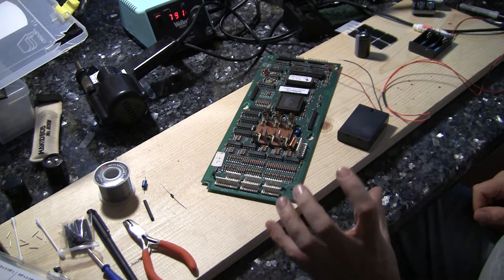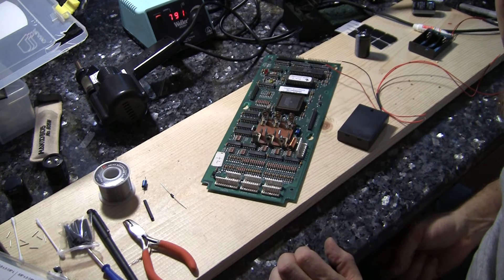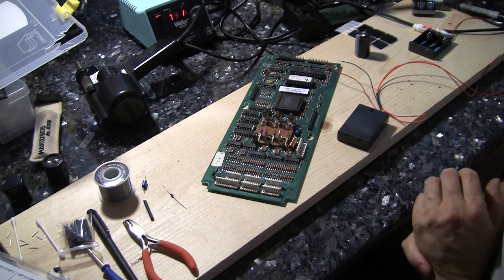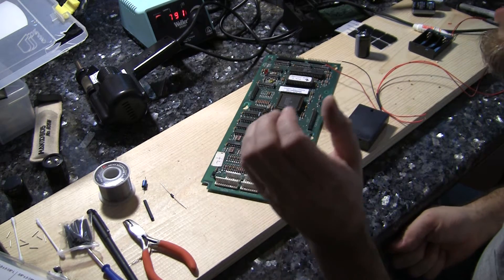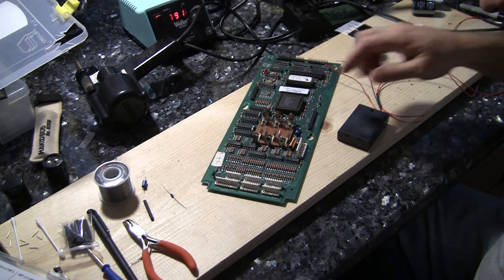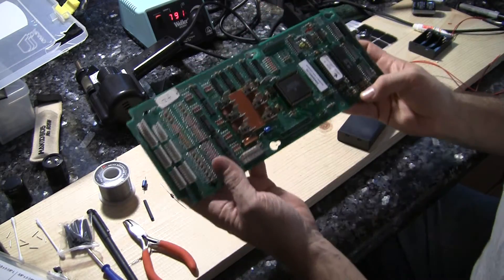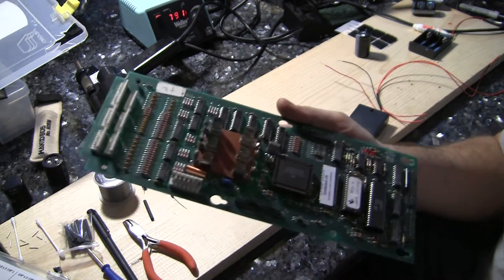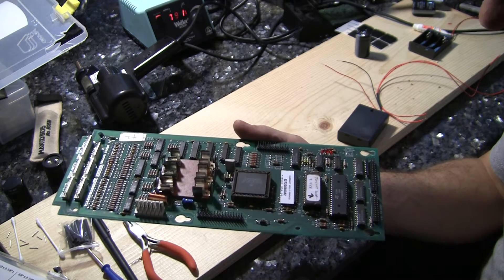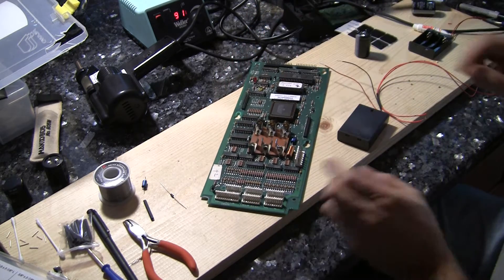So it's always a good idea to get those batteries off of the board. Some of the later models had little daughter boards with the batteries on them so that they didn't necessarily damage the board. But most pinball machines — almost all solid state machines — have batteries in them, and in some cases like in the old Bally machines, they're soldered directly to the board; you actually have to cut them off. At least these have battery holders, but it's still a problem. If you look closely here, I've got some corrosion — see the green right there? That's from some batteries leaking. It's not the ones that I had, but when I got the game this was an issue.